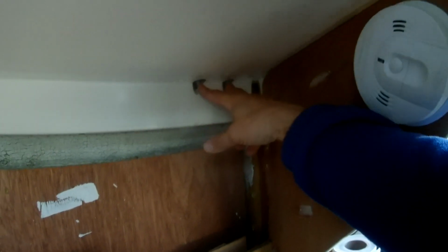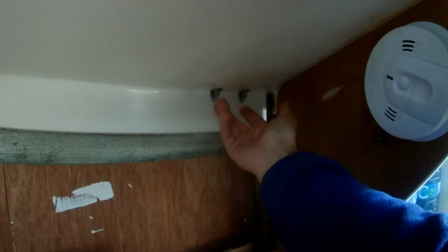This one here, they didn't do that. They just had kind of a trim, and I don't know why they did that, because this is the stanchion bolt, so it's kind of awkward. I'm just going to cut it out, bring it out the same 8 to 10 inches from the wall. And I'm going to build the same cupboards here, so I have cupboards on both sides. And that'll give me a little bit more storage, right?